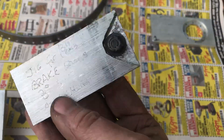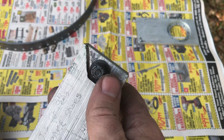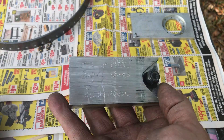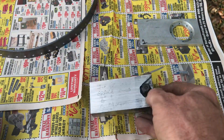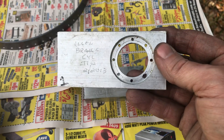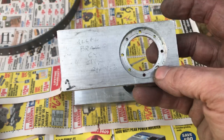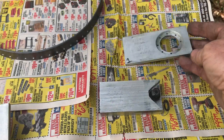Over here, this is a little jig I made for the brake shoes. You'd have to machine the brake shoes — I would clean off the back side of them, and then I could hold this in place to machine the inside of the brake shoes to the wheel diameter. This is just a little scrap of aluminum. And here's another little scrap of aluminum that I made into a jig for the brake cylinders. I drilled the lids, the tops of the brake cylinders, and the body of them so that all the drills matched — a handy little jig.